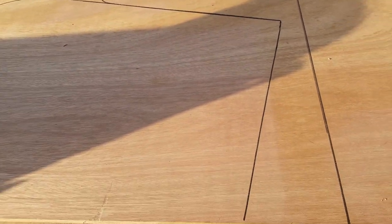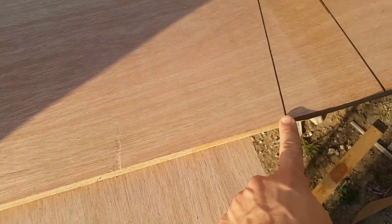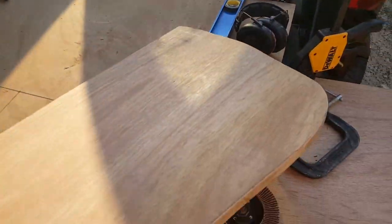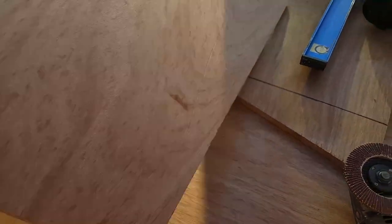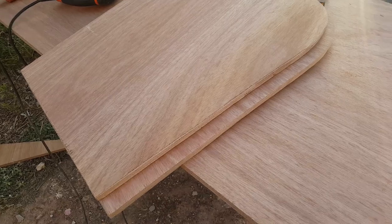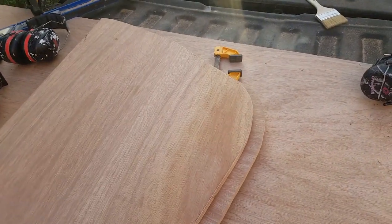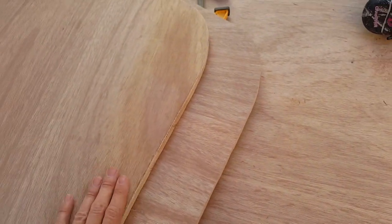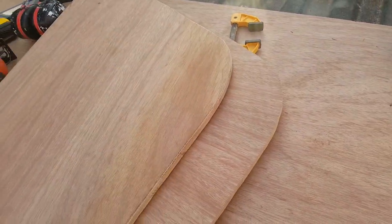The only thing I need to double-check is, because our backboard is 30 inches, we just want to make sure it's 30 inches on that side as well. I just went ahead and sanded all the edges — came out pretty good. Loving this AquaTech. Now that we got this side completed, we'll go ahead and just trace this out on another sheet and that will complete our sides. Looks good so far. We've got two pieces here, that's our left and right side, three-quarter inch, and I used one as a template for the other so they match up perfectly, with all edges sanded nice and clean.